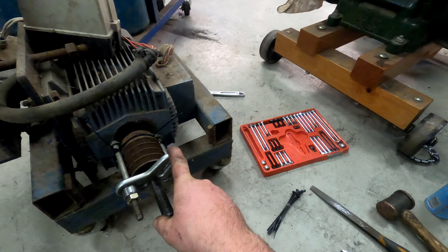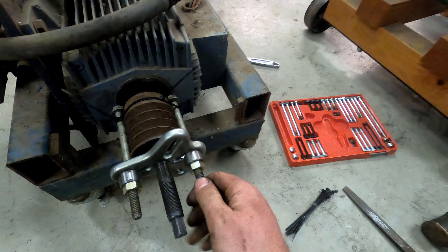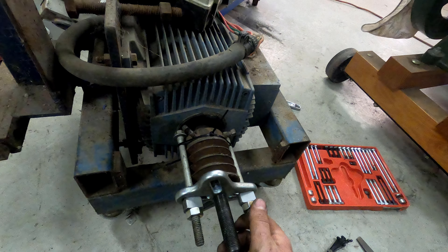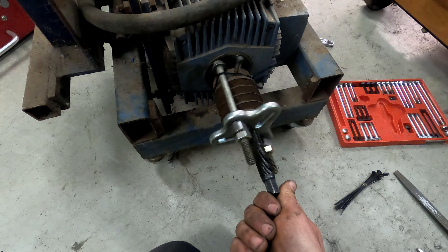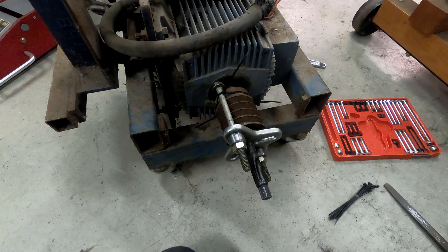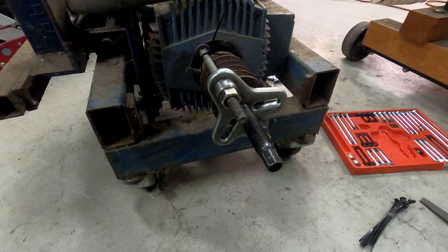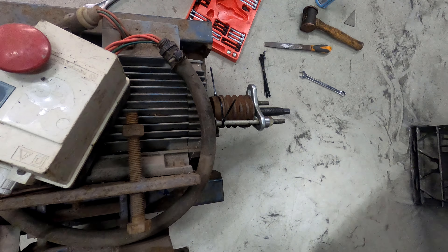This is just a steering wheel puller - obviously I use it for harmonic balancers, it's been pretty good to me. The bolts I had weren't long enough and didn't have enough of a shoulder, so I found these - I think they're LS1 head bolts - pretty large flange, got some engagement there, spaced off some brake adapters, and a nut that just happens to fit. A couple of cable ties to hold it all in place, and I'm going to crank on it. I'm hoping the lube I put in there before means it just pops off nice and easy - otherwise I'm going to lose an arm, a finger, a leg, or whatever.